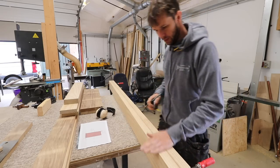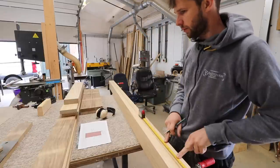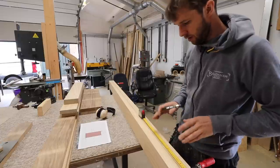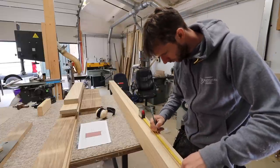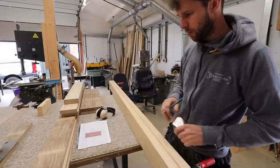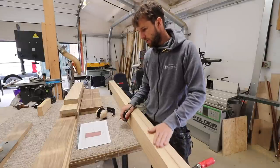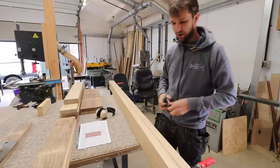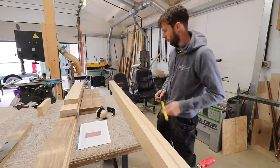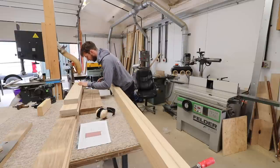Now if we make this end the bottom, we just mark the width of our rails in from them two end marks. So the bottom rail we've got is 220mm. That can be whatever. I won't go much less than 6 inches for bottom and middle rails, but it's not going to make too much difference to the strength of the door if you've got a decent tenon in there as to what size you use. Top rail we worked out from a drawing, so we can mark that on